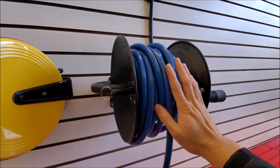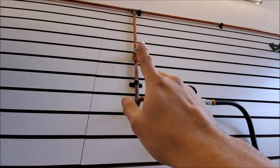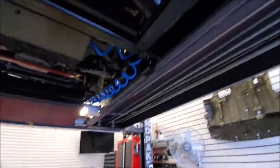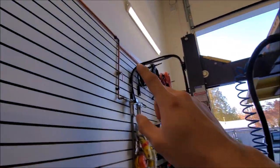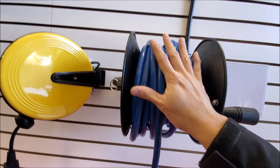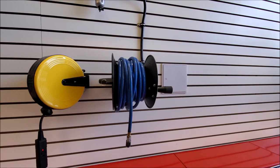Let's say this line has a leak — I can close it, keeping the rest of the system intact. I can still use the air line over there, and the other one, and the whole lift stays operational. Same thing with the lift: if something fails, I can close that circuit and nullify it while the rest stays operational. I've had it happen in the past where an air line leaked and because we didn't have valves everywhere, the whole system was leaking and we couldn't service it.